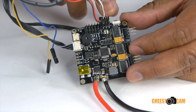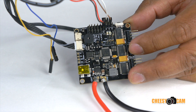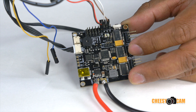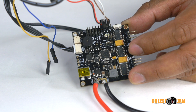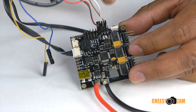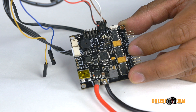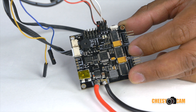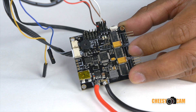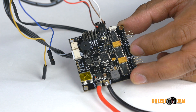Now you have a third axis here. On the joystick, pushing up and down could control your tilt, and going left and right will control your roll. The joystick can't control the third axis, so you're not going to use the A3 port here. All of those options on the board are for if you want to use an external remote to control all three axes — pitch, roll, and yaw. With our analog joystick we're only using two of the axes.